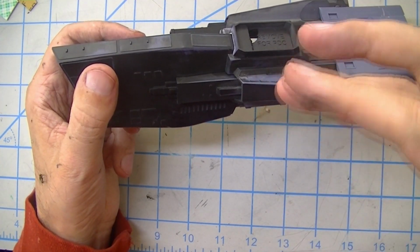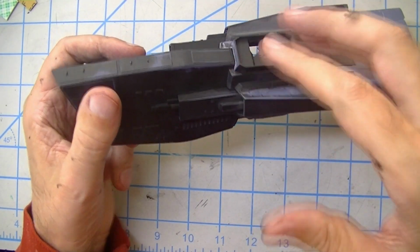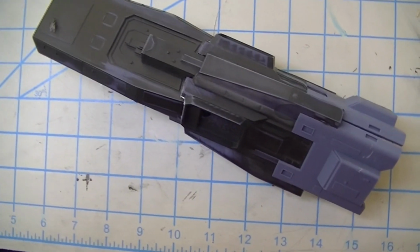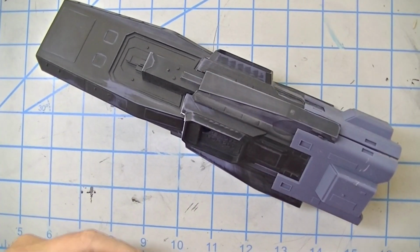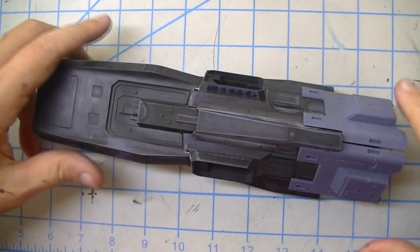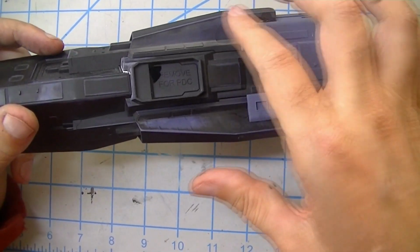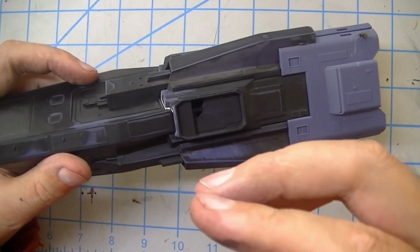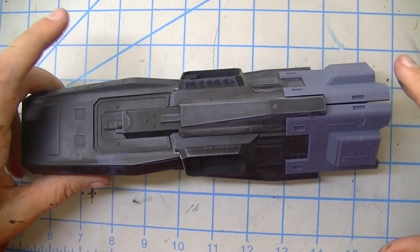And you also have to keep in mind, if you're ever designing features that are going to be assembled from 3D printed parts, the rule of thumb is inside dimensions are small, outside dimensions are large. And you would probably never want to go any tighter than 0.1 millimeters. So I was pushing it a little bit, but the bigger issue is on these larger parts, where everything depends on all the mating surfaces being planar and parallel and square, and so forth.